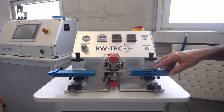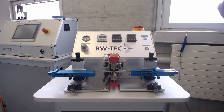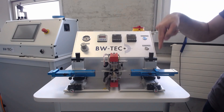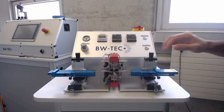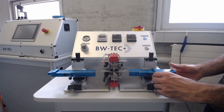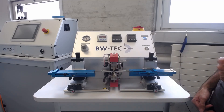To set up a product, the product's guide on either side has to be adjusted to the die to make it concentric with the die. For that, we have two options: moving the Y-axis in this direction and moving the Z-axis in this direction on either side. Additionally, there is a screw where you can move the guide closer or further away to make enough space for the balloon or another part of the product.